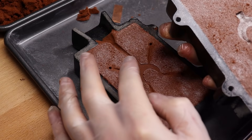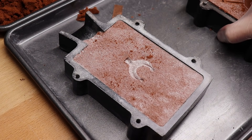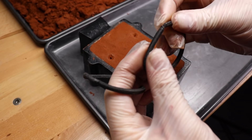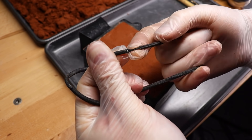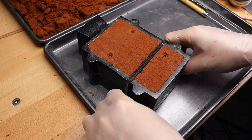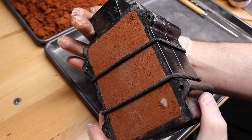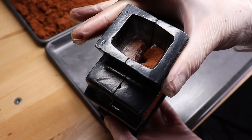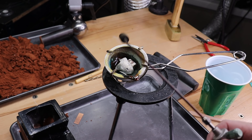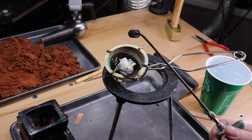If you really wanted to, you could add more sprue going down here, but I think this will be enough. Now we just need to take them and put them together. You need something to hold this together — you can use rubber bands, like these little hair bands I use, but they could melt, so be careful. Try to get them away from the vent holes so they're not covering them and so they don't melt and shoot off. So there is our completed flask mold. Make sure you have your ventilation set up and some eye protection. A fire extinguisher should probably be nice to have too, because if you drip hot metal anywhere it will catch things on fire.